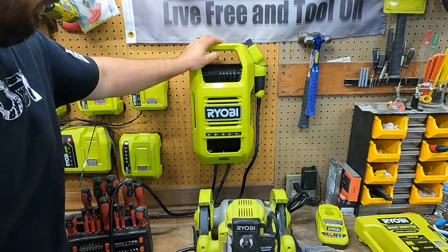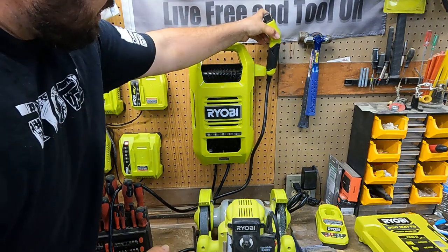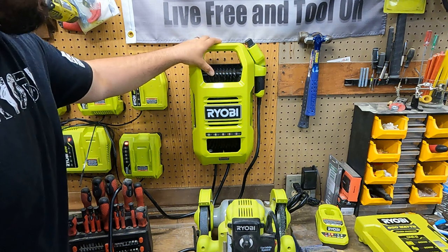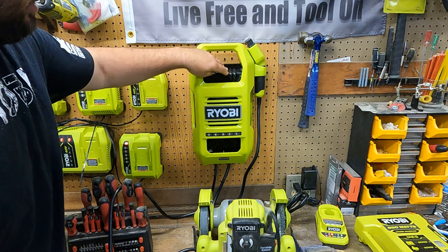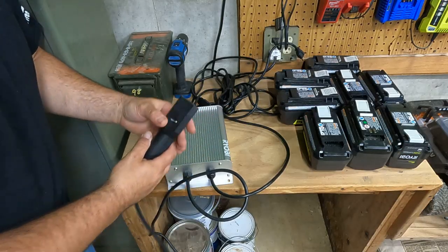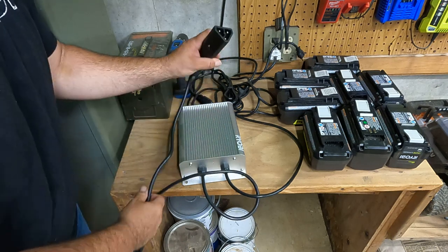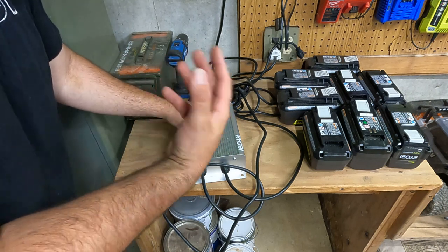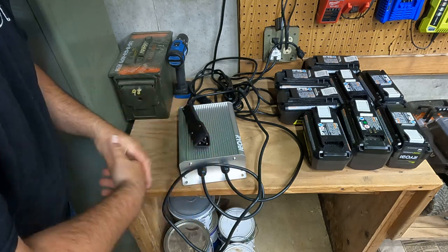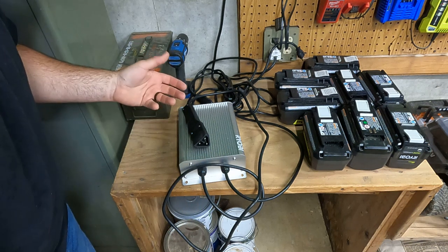How do we charge the units? The 80 volt uses a 14 amp charger at 120 volts — kind of like an electric car with a whip and plug. It will charge all the batteries within three hours. It's built with aluminum internals and cooling fins because it pulls a lot of power and charges quickly. The 48 volt charger charges at 7.5 amps at 120 volts, so it charges slower. You really need to leave it on charge when not in use since it takes much longer — I just charge it overnight to get it to 100%. The 80 volt charges in three hours; that is a pretty big difference.